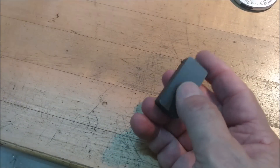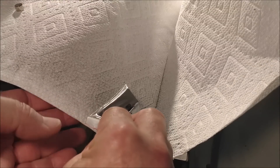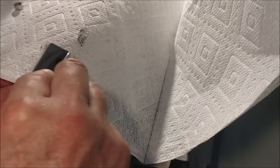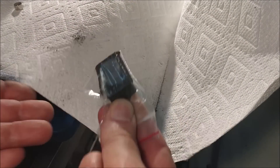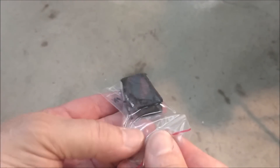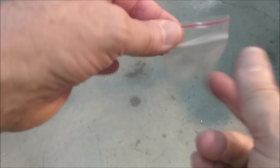Take a light stone to it and knock the grinding burrs off. Here's a little shop hack: if you have a magnet, put it inside a bag. Wave the magnet over debris or small parts you want to retrieve — it will still pick up the magnetic material, but when you open the bag and remove the magnet, the debris stays behind and the magnet emerges clean. If you've ever tried to get cast iron dust off a magnet, you know exactly what I'm talking about. Just don't let the debris follow the magnet out of the bag — that will happen occasionally.